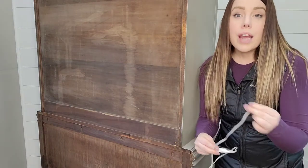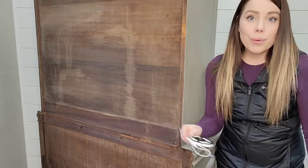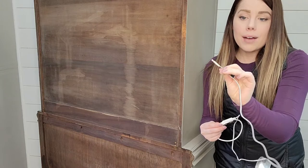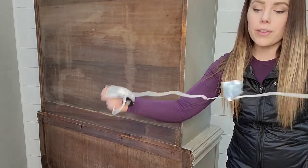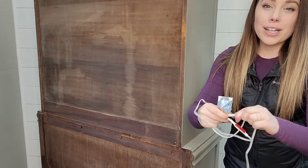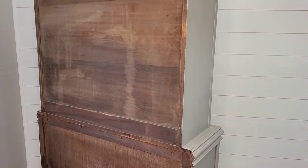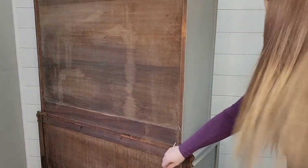We have our tiny little hole that the wire is going to feed through. If you feel the 1/8-inch drill bit is a little too tight, you can drill through a bit more to open the hole up, or step up the drill bit size — whatever works best for you. I unraveled the wire and slid the tape down the cord a bit so nothing gets stuck trying to go through the hole. Now you can see it poking through the other side and you simply pull it through however far you need.